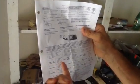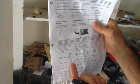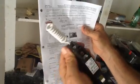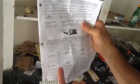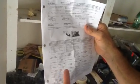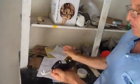It has a shared neutral, a grounded neutral, or it's got a ground fault current. If it trips in 2 seconds, it's got parallel arc fault circuits, meaning you've got two of them tied together, or you've got series arc fault together, which you're looping from one to the other. If it trips in 5 seconds, you've got no fault, you have a thermal overload like on a motor load or something, or you have a short circuit like a short to ground, okay?